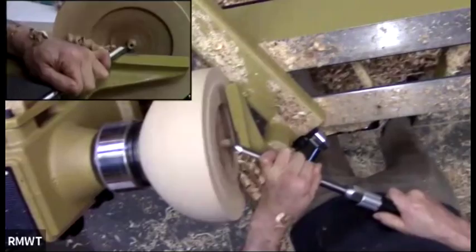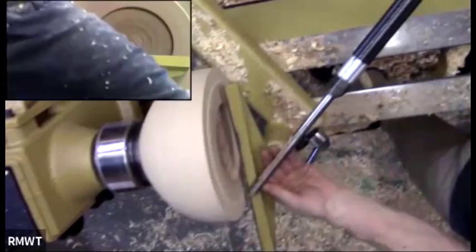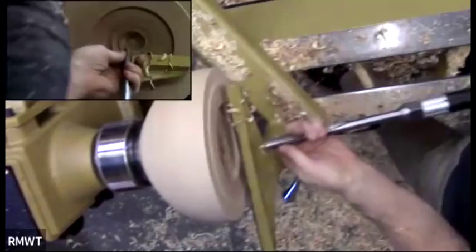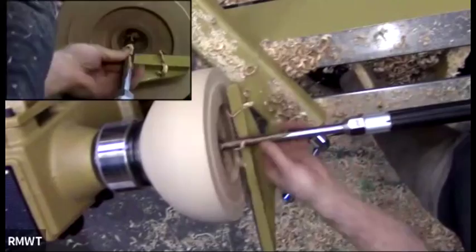Now, at this stage, I've flattened up the middle, but I have nowhere for my gouge to start. I want my bevel to go in at the correct angle, but it won't go in at the correct angle right now. So what I'm doing is making what I call a V cut. So I make space. This cut here still produces a percentage of end grain, but in a minute, once I've got enough depth, you can see my side grain chip there and my end grain chip there. That's not ideal, but it will be in a minute.